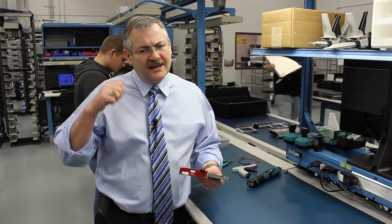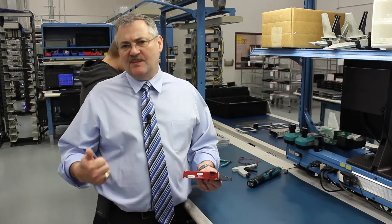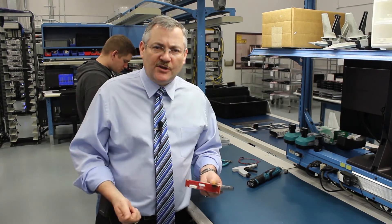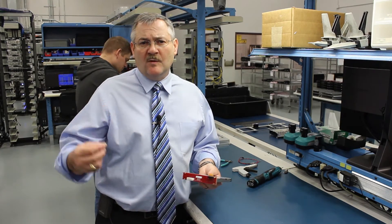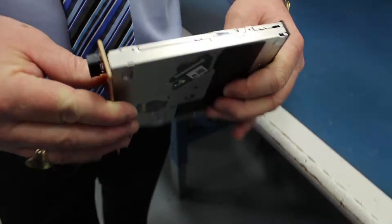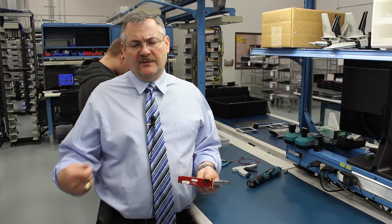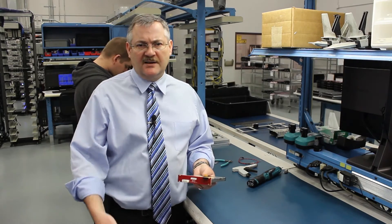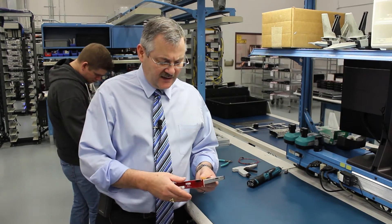So, what kind of connectors? A lot of connectors you have to pick are super high-speed connectors, especially in backplanes for storage arrays. There's a minimum amount of nickel underplate that you should be shooting for, and a minimum amount of gold overplate that you should be shooting for when you pick those connectors — and that's essentially for wear. You want to make sure those surfaces stand up.